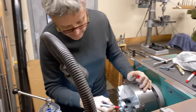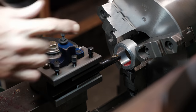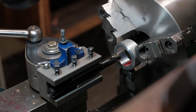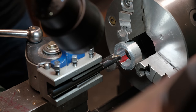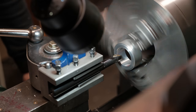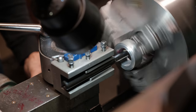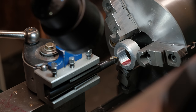When you cut a thread you always check. I'm putting felt pen inside there. First I switch on the lathe and touch the tool so I can zero it or set the dial to whatever number I want. We're going to take a very small cut, then get the thread gauge and actually check it — that's what the red felt pen is for. Checking my thread: 20 threads per inch matches my gauge. Let's make a thread.